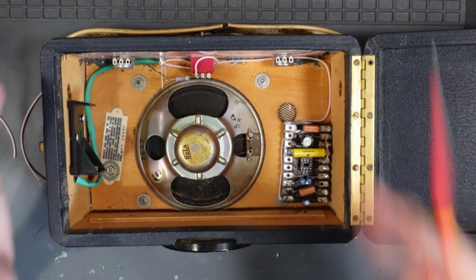It's coming from this part of the switch here, round the outside of the casing and to one of the 2 points on the tag board where live is connected. If you remember earlier on in the video, we connected them together. So I've just gone from the outside of this JFET, run it round. I've also run a 10k resistor to the live side of my LED.